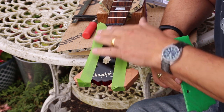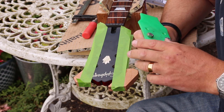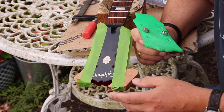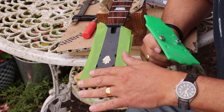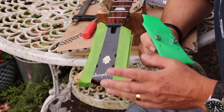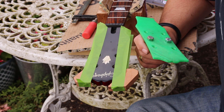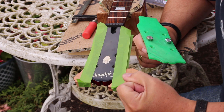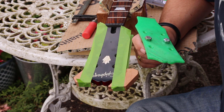A sheet of plywood at the small size you would use there would actually be fairly stable. With a job like this you've got to just not plan on a finishing date — it's no good thinking you want it for a gig in two weeks. Certainly if you're someone doing this at home you might not have the weather to spray the finish and the lacquer and let it dry long enough, because you need a preferably warm and not humid day. You don't want any moisture that's going to get in the finish and make it bloom or discolour — I've had it when spraying in bad conditions and it just never cured properly.